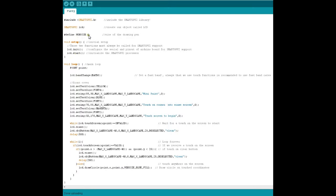Let's increase the pen size by 1 to get a thicker look. So we've increased the pen size to 2. LCD dot init, LCD dot start - all things remain the same. The point stores the X and Y coordinates of touch inputs. We'll be printing 'mini paint' in yellow, 'touch on corner to erase screen' in blue, and 'touch screen to begin' in magenta as the first screen. If we receive a touch input we erase the whole screen and print the object button in the rectangle field.